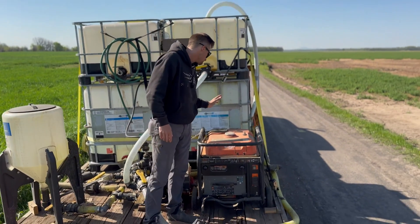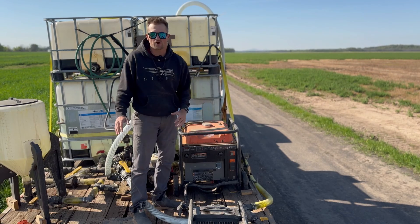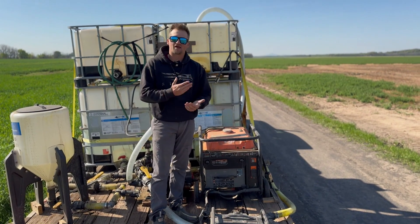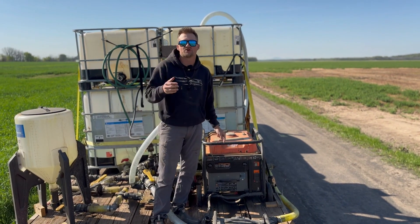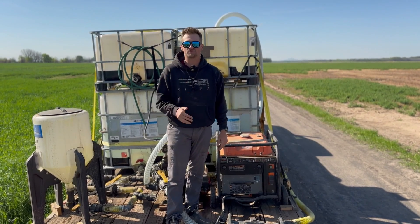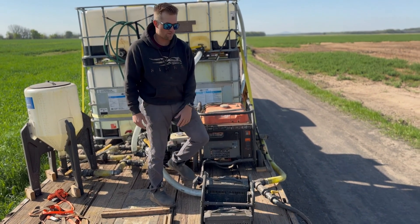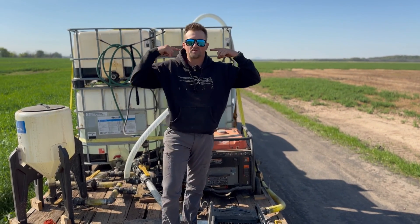A DJI generator — this came with the drone. You can buy another generator elsewhere as long as it's not a dual-fuel generator. You don't want a propane-diesel setup. Make sure it is either a straight diesel or straight gas generator. This bad boy has to be 9,500 running watts — that is the minimum — in order for it to be efficient. It has a built-in connection cord that is built for DJI, which runs into my battery charger. When we're running and gunning, this is running all day long, so ear protection is key.